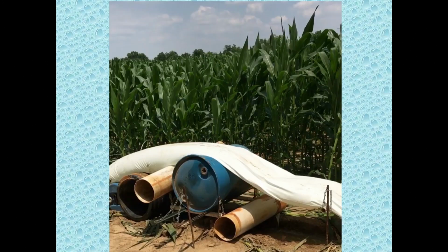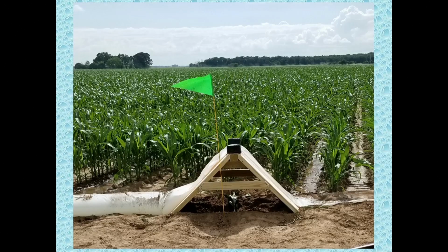I've got other growers that'll put everything they got in the back of the pickup truck to make these inclines. The problem with that is when you go to build another incline, you got to go get another pickup truck full of stuff. The way I like, and the way a lot of growers have started doing here lately, are building their own inclines so that they know exactly what they're doing, and there's no movement of this particular incline. It's getting it up to 2.5, and then it's transitioning back down. There's no slack in that poly pipe, so it'll stretch, and that's a really good design.